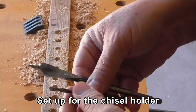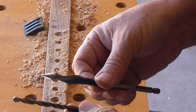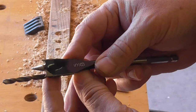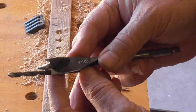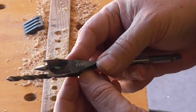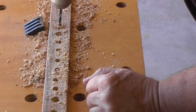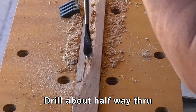For the chisel, I'm going to use this larger drill on the back side. But I need to do a pilot drill all the way through because of the little screw feature that this Bosch drill bit has. So I'm going to pilot drill from the top side and then come through from the back, and I'll probably have to drill the front side back to a regular size. I'm just going to drill about half way through.